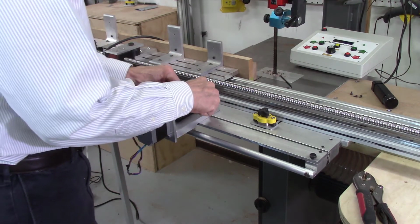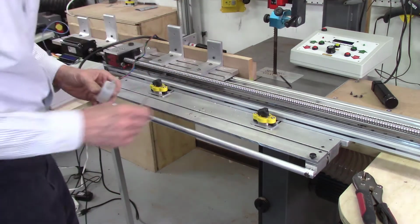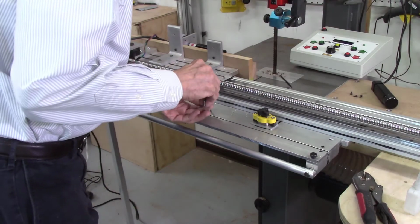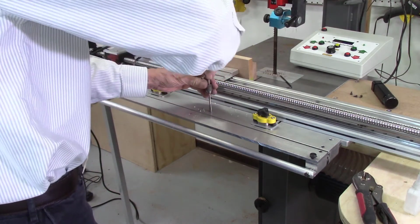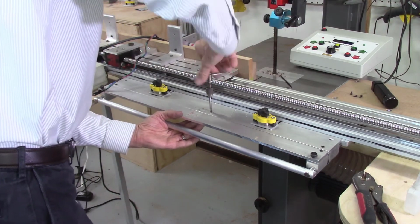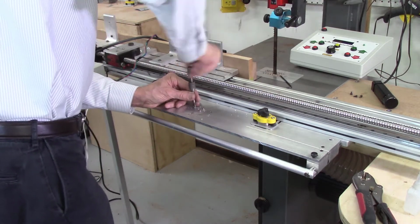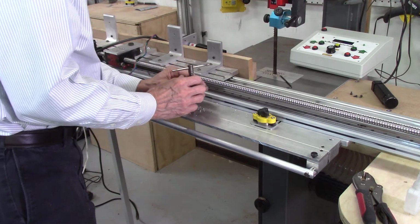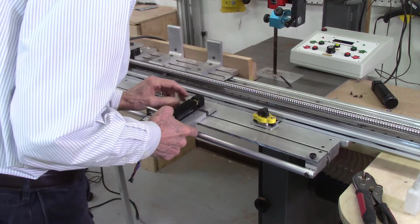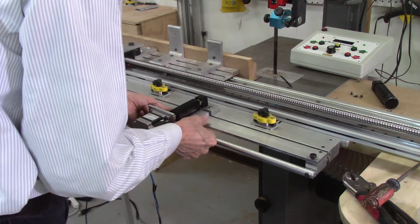So that's there. So that makes that easy. So now you just have to drill and tap the holes for these. So let me try and get these tapped straight. Put a little cutting fluid on my tap. And this is a 10-32 tap. One done, let me go and do the other 2 holes. And now I can drill and tap the holes for the second piece.